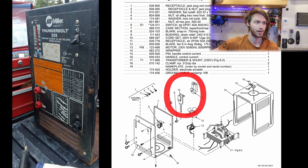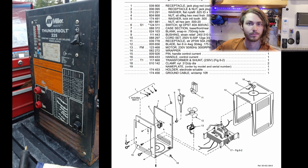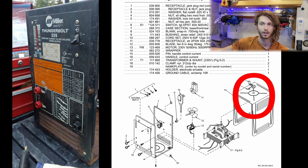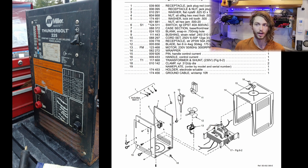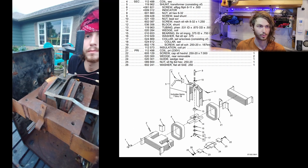On the back is where the power cable plugs into the wall. On top of the welder there's a handle to move the shunt up and down, which controls the output amps of the welder. The inside contains the fan and fan motor at the bottom, which cools down two coils and the shunt that controls the output power. The indicator is attached to the shunt and shows through the front of the unit so you can see how many amps you have it set to.